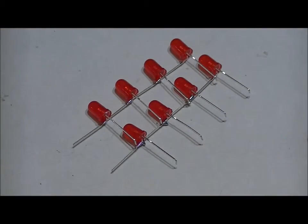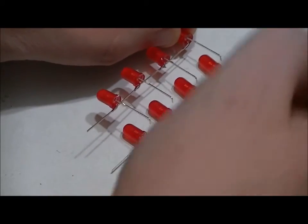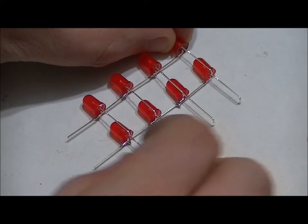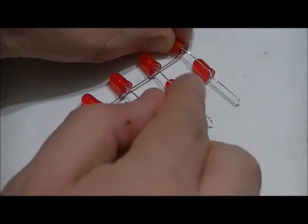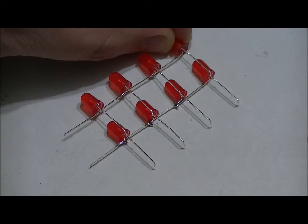What I like to do typically is put a little bit of solder on this pin, just to tin it, line it up, and apply some heat so that one is connected. Then come over and apply some solder to this unit. Make sure that everything's uniform before you continue on, then solder the middle pins, and then reflow the left and the right pins. So I'm going to do that, and I'll do a close-up so you can see how it looks.